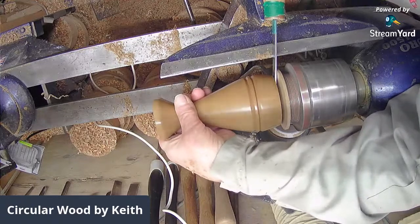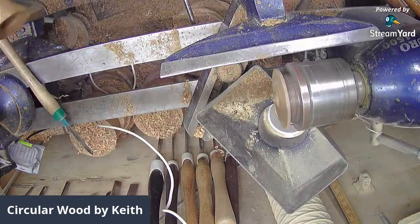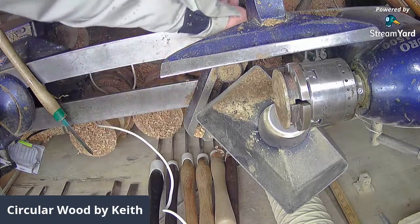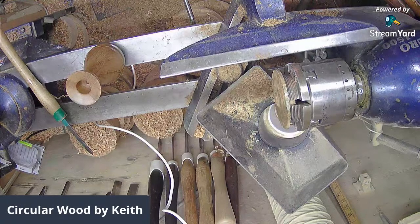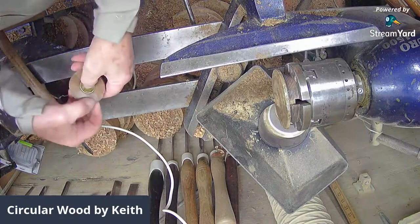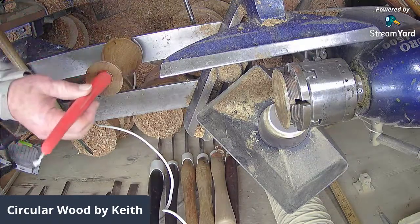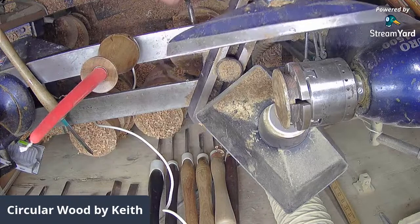There's a question from Seth at Brickhouse Craftworks. Yes, I've just ordered some Hampshire Sheen High Gloss and Microcrystalline Waxes. Can you give me some suggestions on when to choose one over the other? I wouldn't use the High Gloss if you're using it over texture. It does have a tendency just to stay in the textured bit and turn white for some reason. Again, that's quite often because you've over-applied it. Too much wax. Not every time, but even Martin says it's a problem.